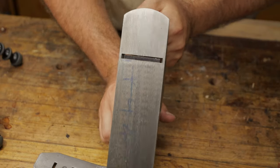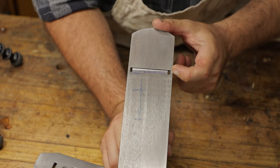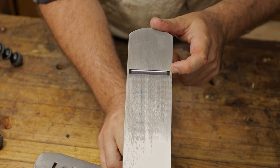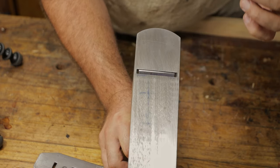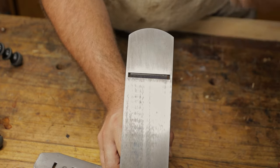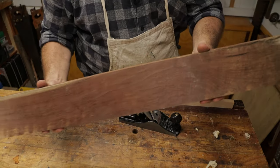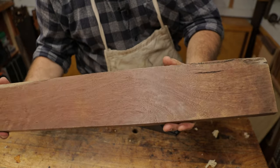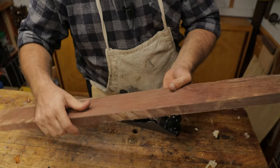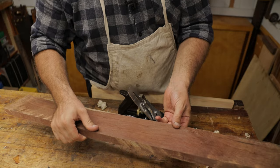We can see that with the replacement assembly in here, that gap has gone from maybe three to four millimeters down to maybe one and a half to two millimeters. That's going to make a remarkable difference when trying to hand plane figured woods and help to prevent tear out. I've got the curliest piece of hardwood I can find here - there's a lot of reversing grain everywhere, curling around on itself as a lot of Jarrah does. So let's jump this in the vise and see how we go.